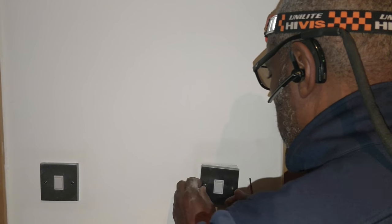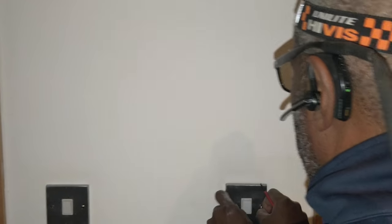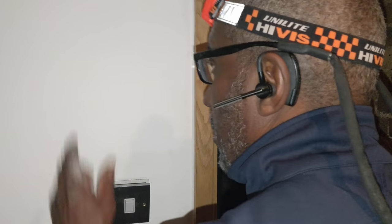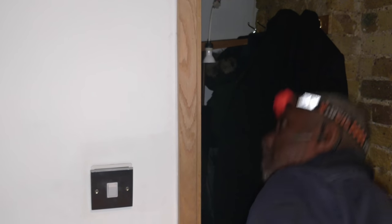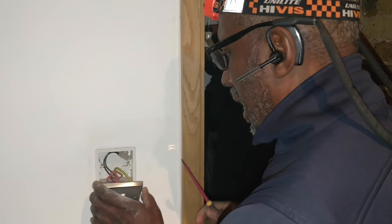For the one in the bathroom - there are two lighting circuits in there. If we're going to fit those 240-volt ones in the bathroom, we'd have to take the MCB from one side and put it on the other side to be protected by the RCD. It's not a major job - just take it out that side, put it on this side. At the moment it's not RCD-protected because it's low voltage.